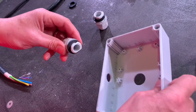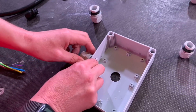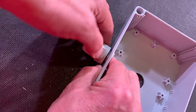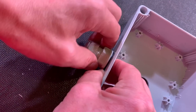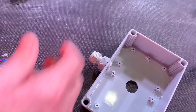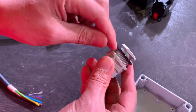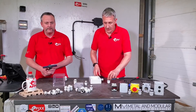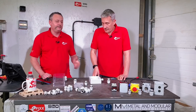This Quick Fix gland is going to go into the 20mm hole already prepared. Push it in - you'll see the longer side - tilting it into place, pull back, and then tighten up anti-clockwise on the lock ring, tightening up the gasket seal onto the enclosure. That gasket seal will return the IP rating. This is an IP68 gland. The important thing with many IP68 glands is making sure you have a gasket seal between the enclosure and the gland itself, as that's often the weak point.